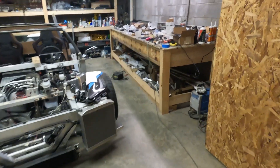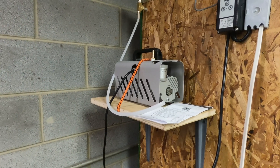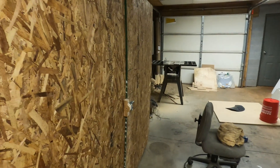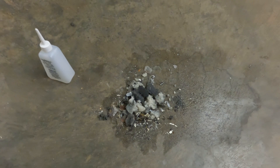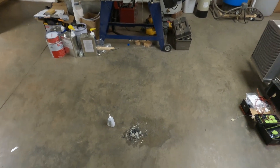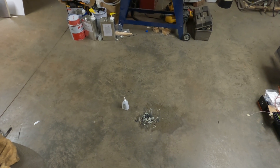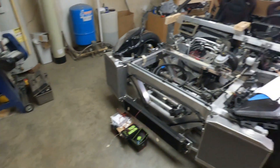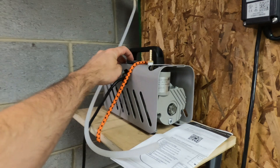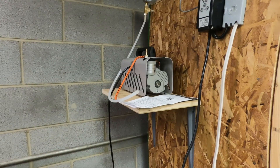On the vacuum pump — here it is. I did manage to salvage the pump. Although it had enough epoxy in it to lock it up and completely shut off, what I did was take it apart into a lot of pieces and clean the epoxy out of it. This is the epoxy that came out — it was completely full. Some places it had mixed with the oil and turned into a foamy solution; in other places it was just locked up solid. The flywheel and the little fins that create the vacuum — the little blades inside — had locked up completely. I had to take an arbor press and press them out, scrape epoxy off every part, and put it back together. I did manage to get it working again.